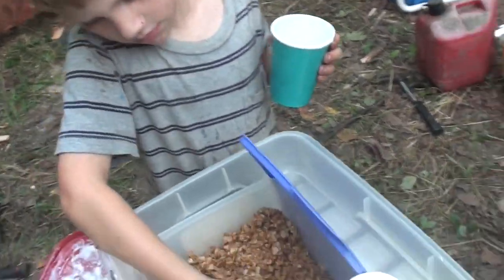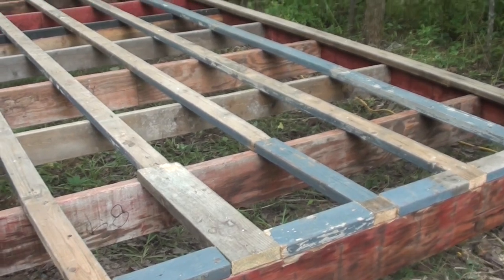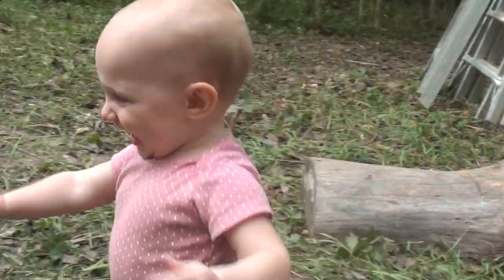I've had some granola and milk for a snack. Tell us your progress — it looks like you've made a lot of progress! These boards are the precursor to the subfloor — we call them battens. The reason we're putting these boards down is so when we put the actual subfloor, there won't be any sagging, warping, or movement. We had lots of two-by-fours but not as many joists, so we used what we had. The kids did great — once they understood what was going on, they were all in, racing to drive the nails. Kids love work when they have purpose.